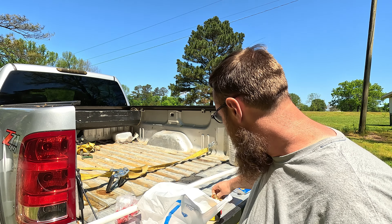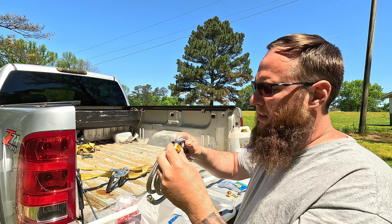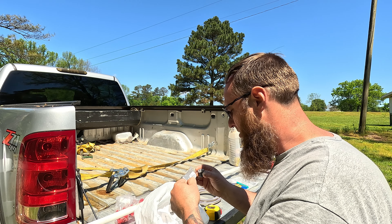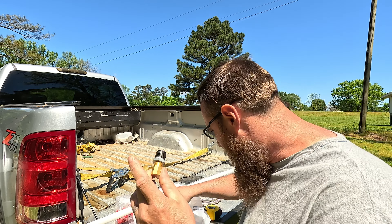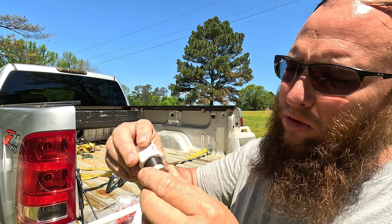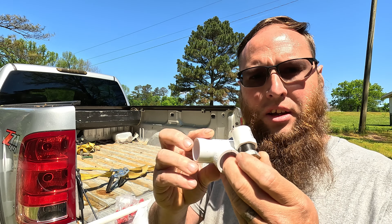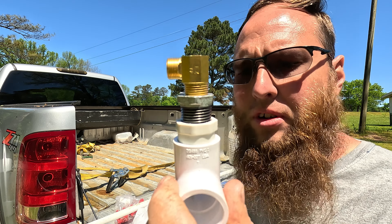The kit has a hose and fitting. We're going to screw one end in and this will go into the rain barrel, and this hose will come out and go into this. You're also going to need a half-by-three-eighths bushing - it's actually going to thread into this. Then you'll also need a PVC three-quarters to half reducer, which will screw into this and allow you to put a piece of PVC in. I'm making a T - mine's going to be in the middle. That's all you need to get into three-quarter. It's not a whole lot.